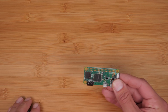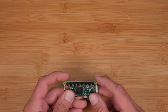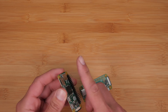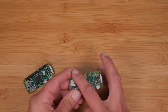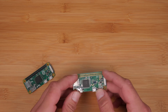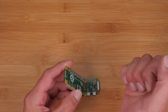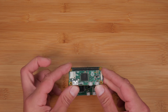One quick note about the Raspberry Pi Zero you choose: you want the one with no header. They also sell ones with a header attached and you don't want that. The header is used for connecting hats and cables, but we're not going to be doing that. The pogo pin system requires no header — so if you bought one with a header, you need to either buy a new one, or desolder all the pins using a solder sucker to remove the solder and pull it off.